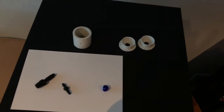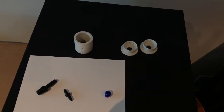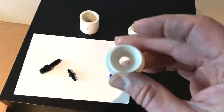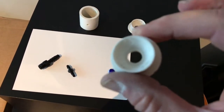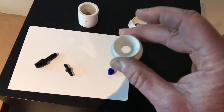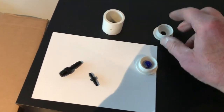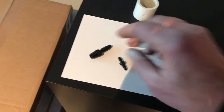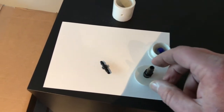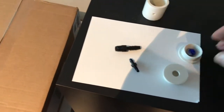I'll start with an update on the pump design. We now have one 3D printed part that fits inside a 1-inch PVC pipe. It's basically a funnel that goes down to a hole about 12 millimeters in diameter, which holds a marble. It also takes the spigot out the top, making this the water delivery system. By making these two pieces identical, you only have to 3D print one design.